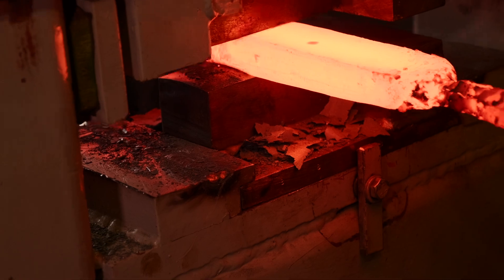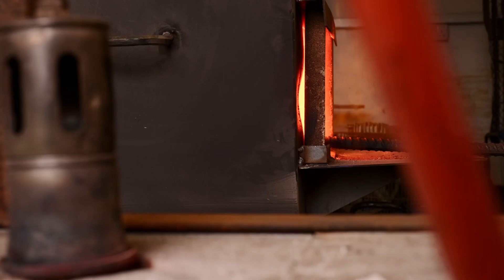I've had great success with doing this, making stainless clad Damascus. I use an O1 core material, but I don't use a stainless steel that stays soft on the outside. I mentioned in a previous video that laminated materials with a hardenable core and soft cladding are prone to centreline cracking, and that's not what we want. I've done quite a bit of experimenting with using a hardenable stainless cladding — the same stainless steel you'd use to make a stainless knife — on the outside. We developed a subsequent heat treatment procedure that will normalise everything and allow you to harden up the core, and so far I haven't had any signs of cracking or delamination whatsoever. So it works, though it's not the easiest thing to get right or control, but it can be done.